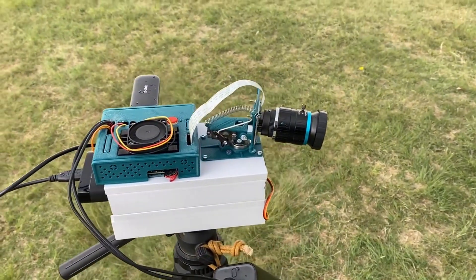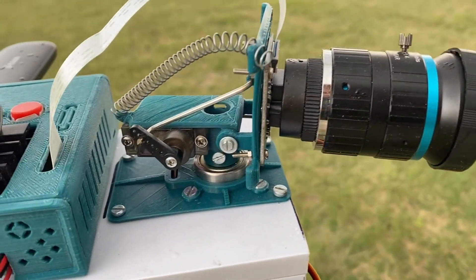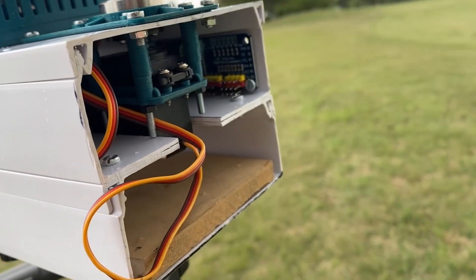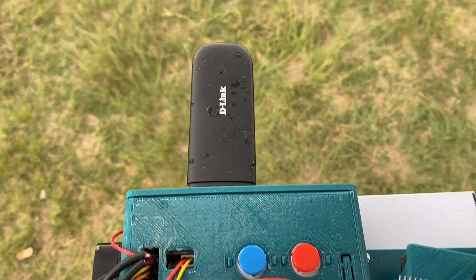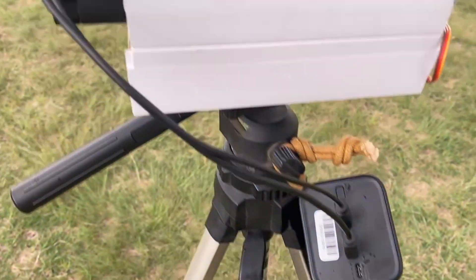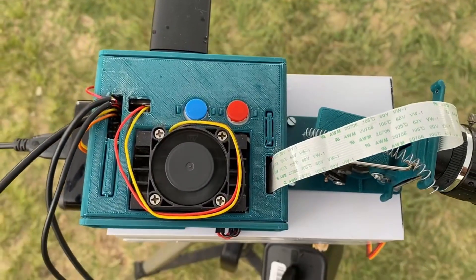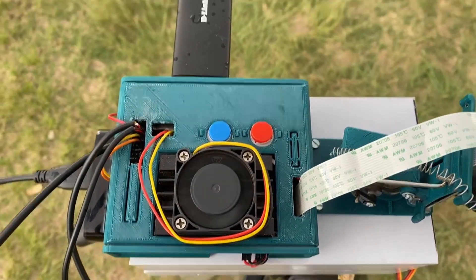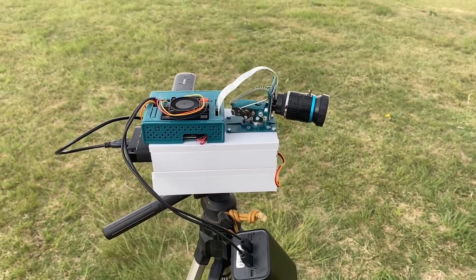There are five main elements to this system: a high quality camera with a zoom lens, servos which increase the field of view of the camera, a communication system between the player's smartphone and the system, a power bank which powers the main control unit and another which powers the servos, and an Nvidia Jetson Nano. This component is crucial as it's responsible for image processing, communication with the mobile application, and controlling the servos.